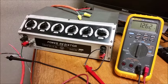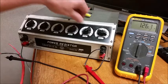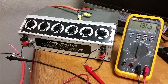So you measure that, and we read something that jumps up, and now we're reading this. You want to think that's close enough? It's not. That is another 1,000 foot of cable or some kind of corrosion or resistance in that cable. If you've got a butt splice that's been there for a while, don't have water issues, but corrosion is an issue, that certainly could be a problem.